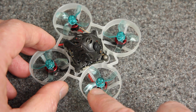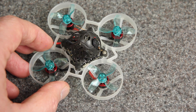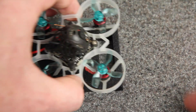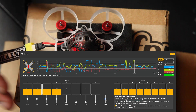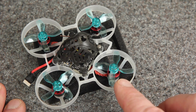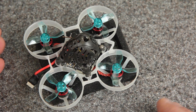It's worth pointing out that I had never lubricated these motors before — this was my first time with this drone, and it's relatively new. I've only flown it a few times so these motors are in good condition. Putting foam underneath definitely helped give more reproducible results, but then I ran into a new problem — it turns out if the motors spin at just the right frequency, you can get a resonance going through the entire frame which makes the whole frame buzz. I guess it's kind of like the opera glass phenomenon for whoops.